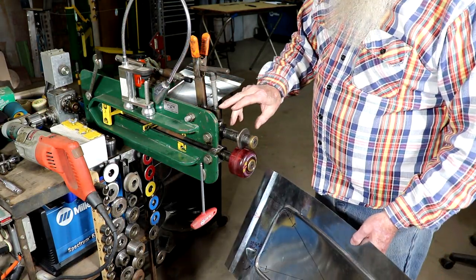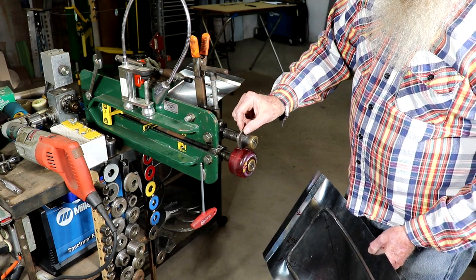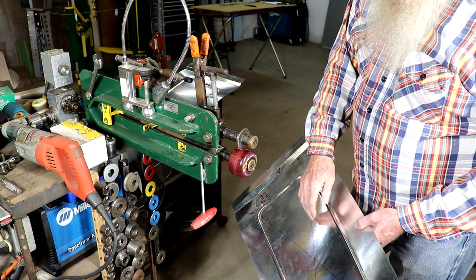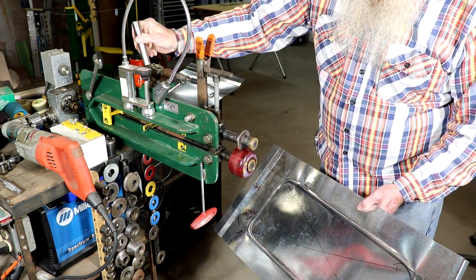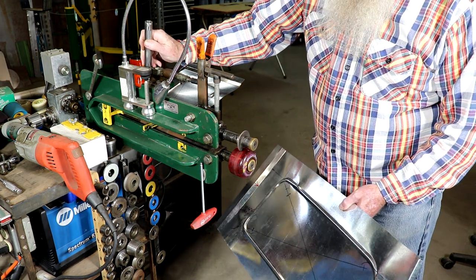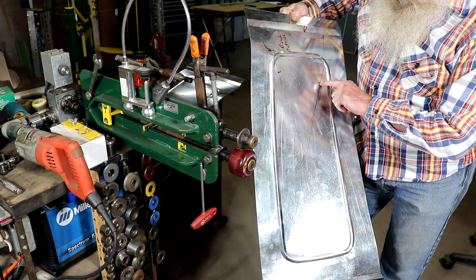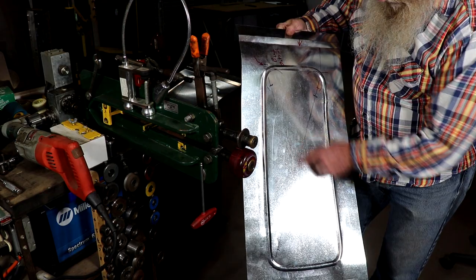What I have set up on my bead roller right now is a very soft skateboard wheel and a flat washer that has been brought to somewhat of a point and then polished off. This is not going to cut — it's going to leave just a groove in the top surface, but it won't cut through. I have it adjusted so it just barely goes down into the wheel, maybe an eighth of an inch, maybe three-sixteenths — not very much. I have a line here and a line here which is my start and stop area, so I'm going to go across here, then come back and go across here.